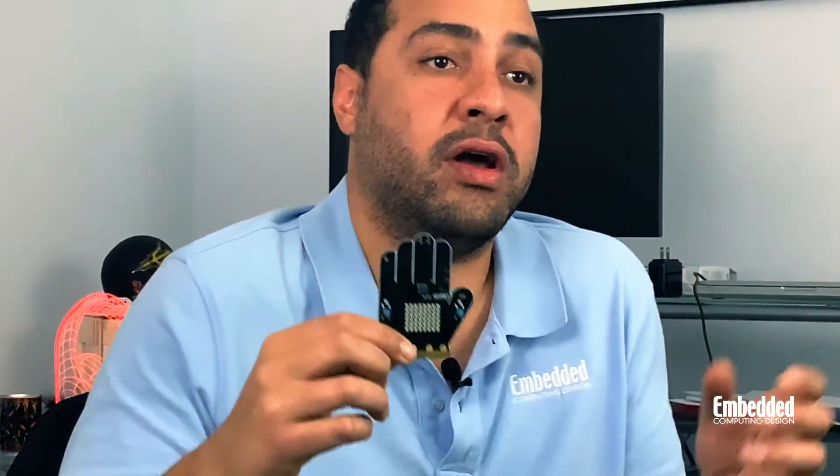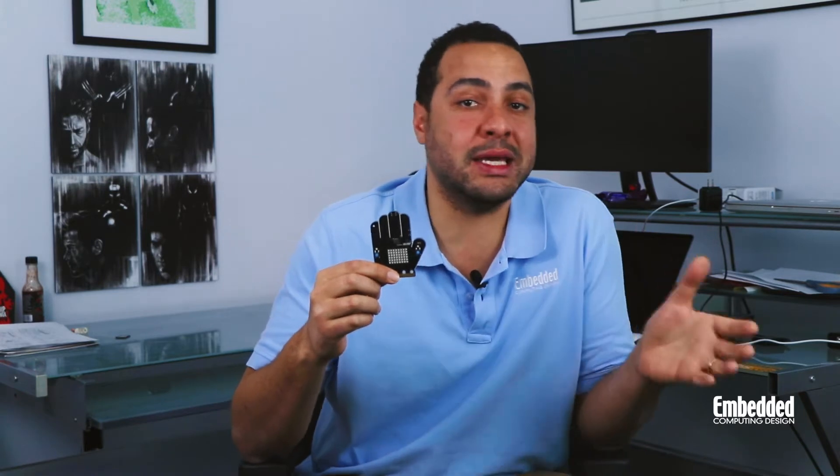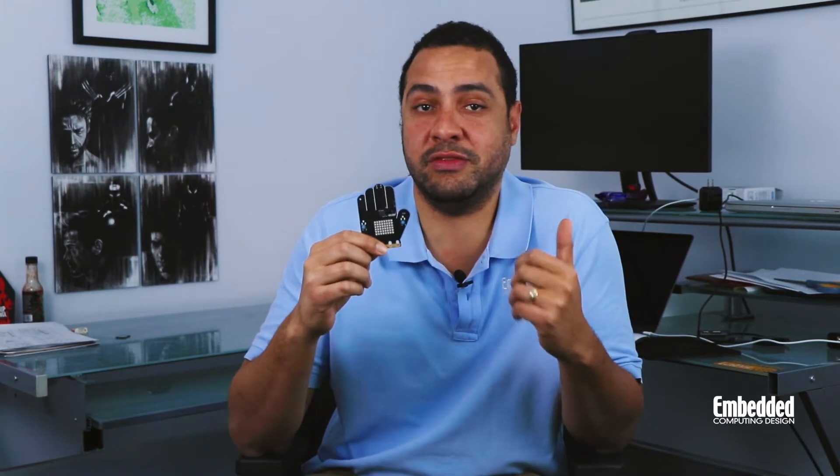Another treat on board the Learn Inventor Kit is the Espressif ESP32 modem. The Espressif modem runs a Bluetooth low-energy stack as well as Wi-Fi, which is perfect for developers interested in prototyping BLE applications or even beaconing. This also allows the ESP32 to enable an essential feature for IoT developers: the ability to write programs downloaded over the air directly to the aforementioned flash storage on the board.